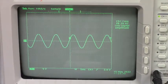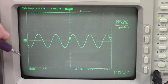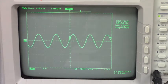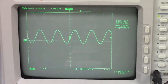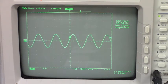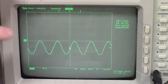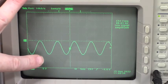Now here we have a sine wave of 5 volts peak and minus 5 volts peak, for a sine wave of 10 volts peak to peak, running at almost 100 hertz. Now with my circuit, we can lower or raise that sine wave above and below ground. The hill of the sine wave is at 0 volts - at ground - and the valley of the sine wave is at negative 10 volts.